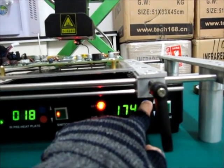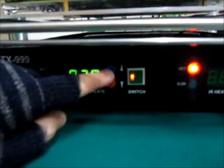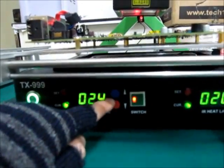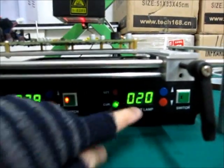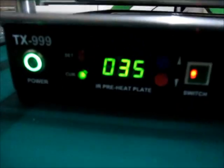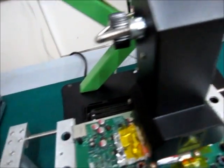Remember to make a gradient. We are going to start heating to 150. When we reach 150, I'm going to set more to 180. When I reach 180, I'm going to turn off the top heater and then go to 200 on the bottom heater. I'm going to leave it there a little bit and then start doing the same with my top heater, starting at 180 then 200.